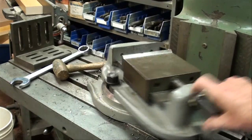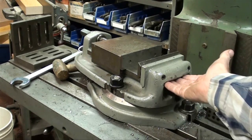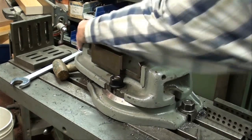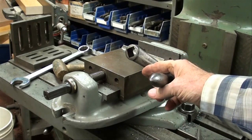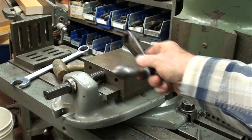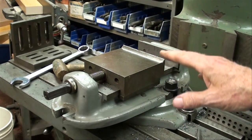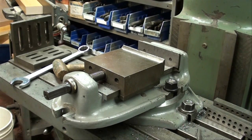That's a nice vise. Another thing I like about this vise — it has a handhold right here, so when you do have to lift it up, you've got something to hang on to. Make sure that you have a nice crank wrench for it. Those are handy. Never strike them with a steel hammer, always with a lead or brass. Now I've complained a little bit about how heavy these vises are, but if they aren't heavy they really aren't going to be any good, because the mass of cast iron is what absorbs all the vibration and makes it a usable vise.